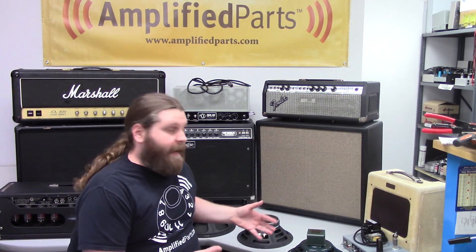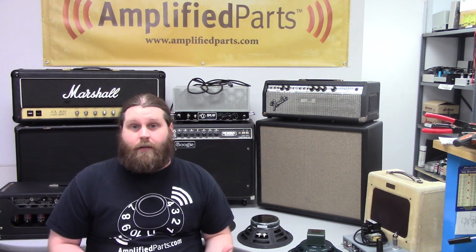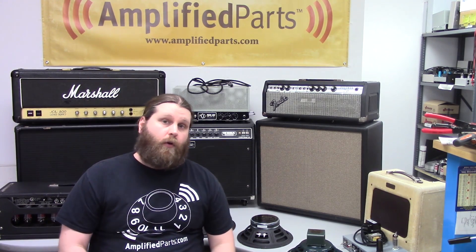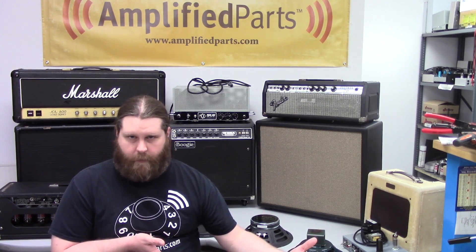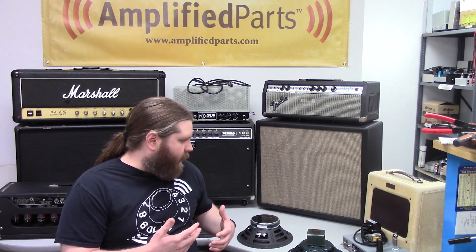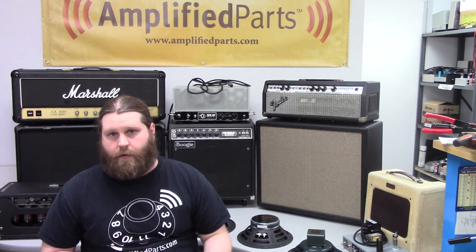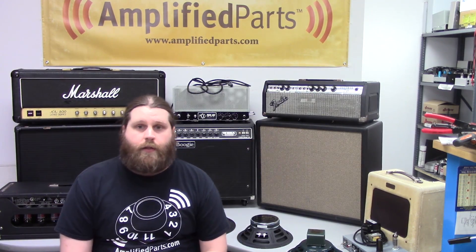So we covered the three different magnet types and talked about their response, cost, and characteristics. Everything else is really up to you. If you want a British tone, you might go with something like a Celestion or an Eminence with a British flavor. If you want that classic American tone, you might go with a Jensen — they're nice and clear, classic American, and you find them in most Fender amps, while Celestions are in a lot of British amps. You can get on the internet, hop on to JensenTone.com, check out speaker samples, look at all the different specs, and see what appeals to you most in terms of the tone you're looking for.